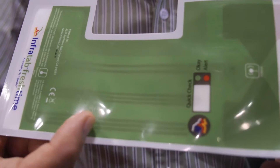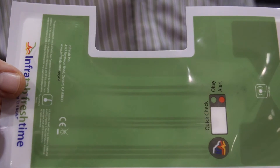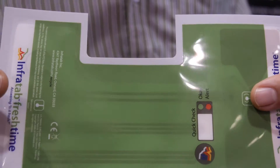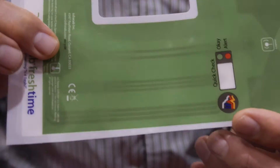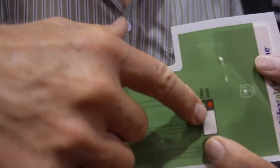You'll notice that there's some distance between the RFID and the temperature sensor. This is an 11 centimeter tag. We make these in various sizes, between about four centimeters and hundreds of centimeters — we've made them many meters long, separating the RFID from the temperature sensor. The battery lasts at least a year. Most of our customers reuse the tag about 10 times before it runs out.